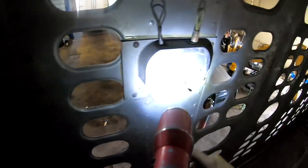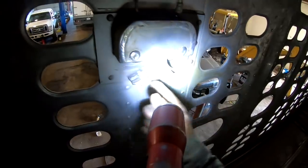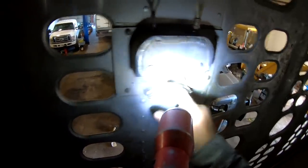And I took this piece here from the gate sagging, because of that hinge over there being bad, it sagged so bad that it wore this almost clear through. So I welded this and ground it till it was flat again. And then this piece up here, I welded it, I put that strap on the one side and fixed all that. And then I welded it here, all the way up to here. So that's pretty stout now. They won't be kicking a hole through that anytime soon.